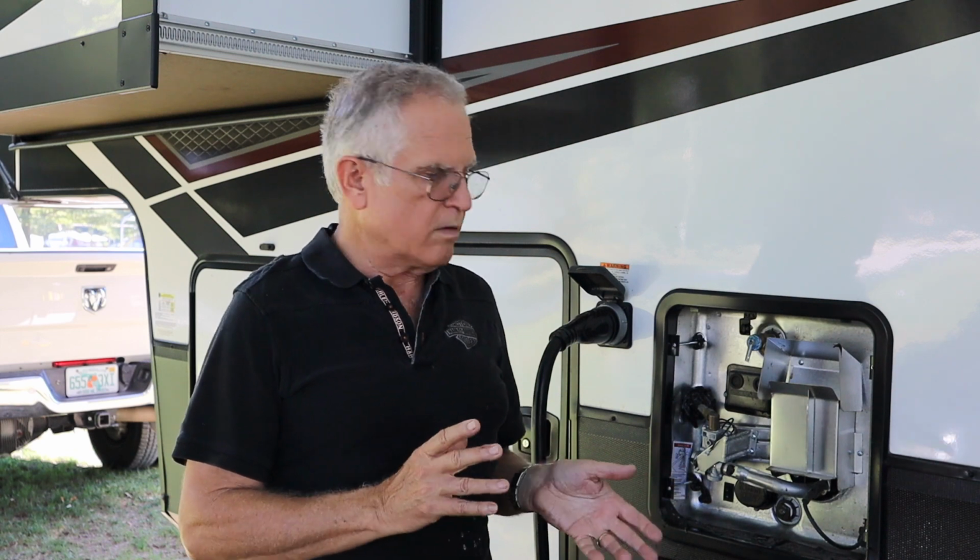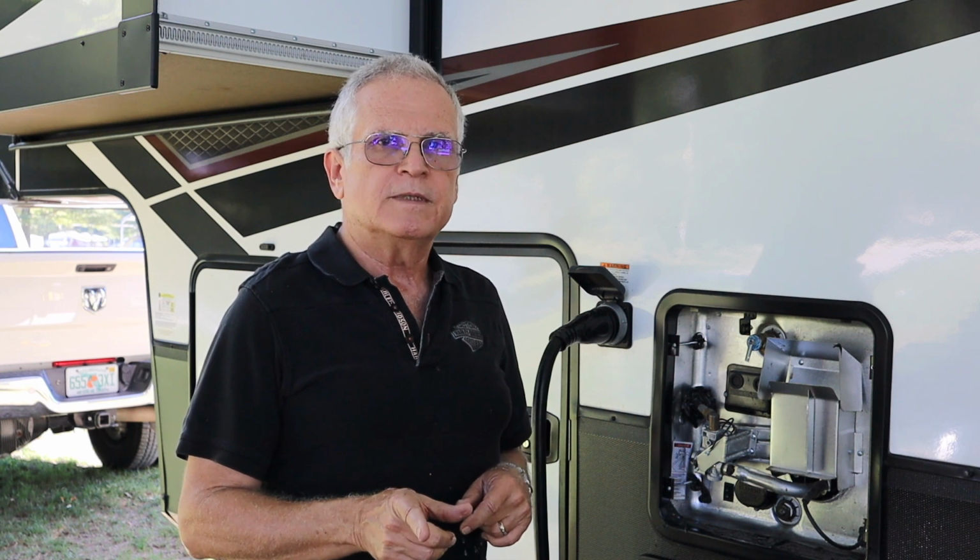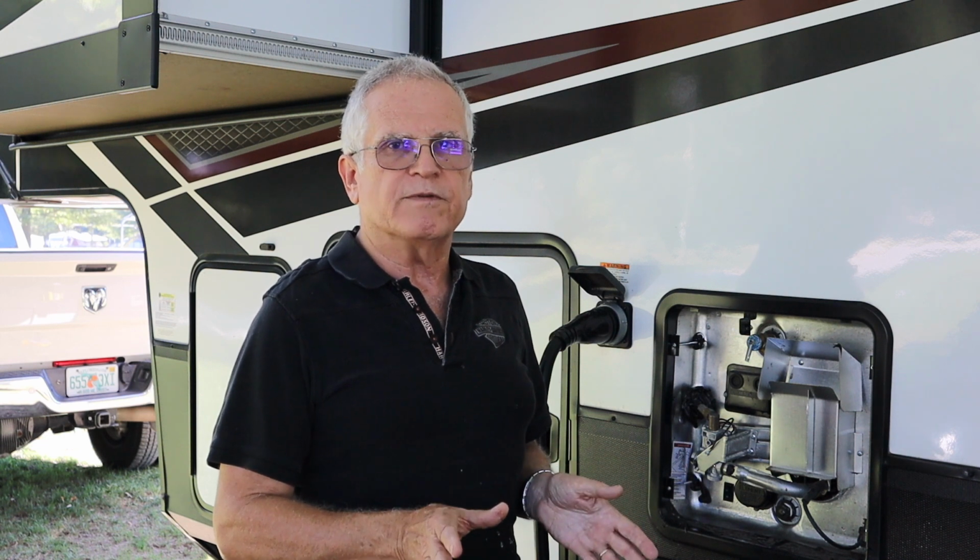We've got the new anode installed, and we've got it tightened down to where I don't think it's going to leak. We've got the water turned on. Now the next thing is very important. Make sure you allow the hot water tank to fill completely before you turn the elements back on. You don't want to ever turn on either the gas or the electricity to your water heater until it is full of water. Now the way I'm going to do it, I'm going in the house and I'm going to turn on the hot water faucets in both the kitchen and the bathroom, and make sure all the air's out of it before we turn on the hot water tank.